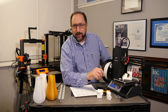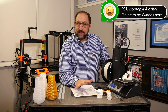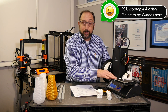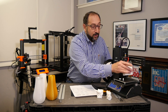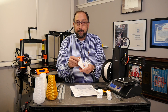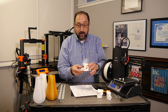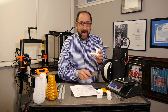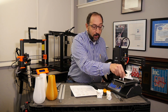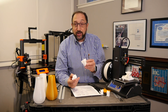I'm still not in love with this print surface — it's still difficult to get things off. But if you wipe it down with alcohol it works quite a bit better. Just don't leave any damp alcohol on the print surface when you start your print or it will not adhere. For this larger flat-bottom print — the Kickstarter calibration item — it stuck quite hard and I had to resort to a metal paint scraper to get it off.